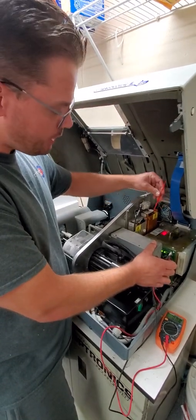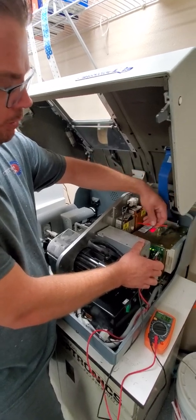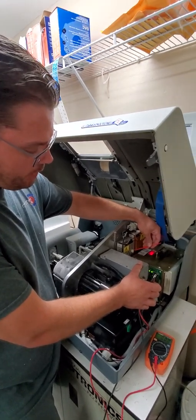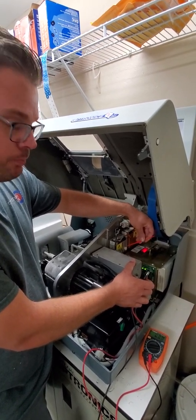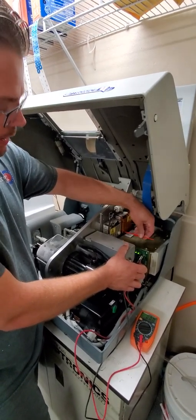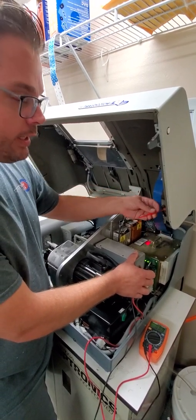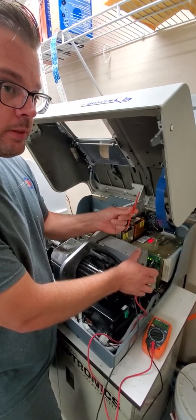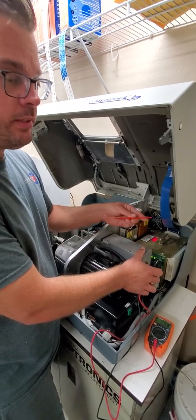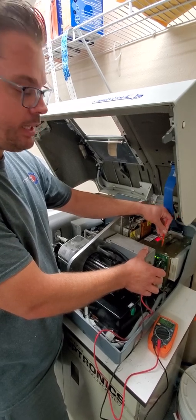On a 6E, this 5 volt power supply will be over here in the back, and the 24 will be over here in the front. Most 6Es also will have the same nut with the hole in the center. Now if the nut is missing, right in this general vicinity you'll have a hole, and if you look through here with a flashlight you'll see the little flathead screw to adjust. You'll need a plastic screwdriver to go in there and adjust. If you use a metal one, you have to be extremely careful, because if you touch anything on there you can more than likely short out the entire power supply or cause severe damage to the card cage.